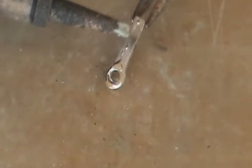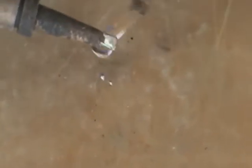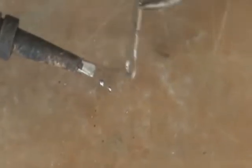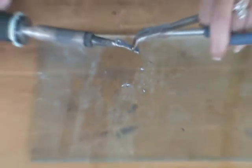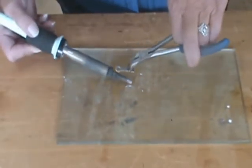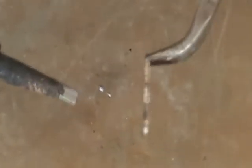Just make sure that you get the sides, the flat side, and even around the top. You want to make sure that it all gets very evenly covered. If, when you're tinning the hanger, it gets in the hole, that's alright. Just put your iron on the back side and let it fall through so that the hole is open again. Once it's done, it is very warm. You want to set it aside to cool.